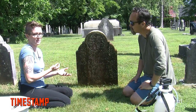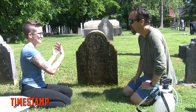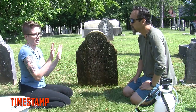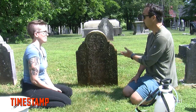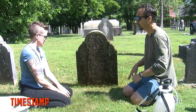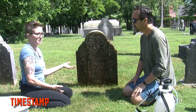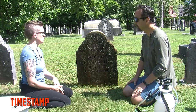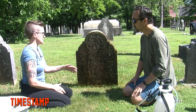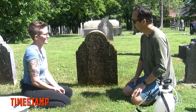A lot of cemeteries want to make sure that I'm going to do it right. They want to make sure I'm not coming with my own sandblaster and blasting a stone from 1795. But usually as soon as I say D2, most of them are like, okay, great. You don't want to come in here and blast these with a pressure washer. Everybody thinks you go in there with a pressure washer, we'll get that thing clean in 30 seconds. The pressure washer does work quickly, but it can really damage the integrity of the stone over time. If you see a stone that's been pressure washed, the surface is a lot of times pretty granulated and damaged, which might ultimately reduce the life cycle of the stone.